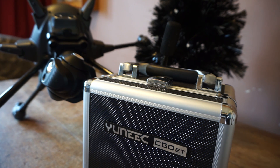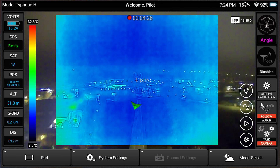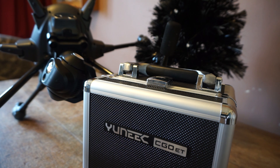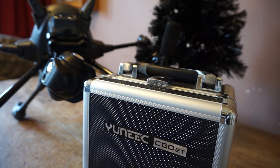It is a low light 1080 combined and switchable picture-in-picture or superimposed camera with temperature measurement and display. You can have a multi-colour spectrum which you can change to show different visualizations of heat sources — it's very customisable. It's also got different temperature detection scales for specific ranges, so if you're after body heat, for example, there's no point going much more than 40 degrees C, whereas if you want to look for other things, you can change the temperature scale.